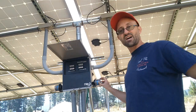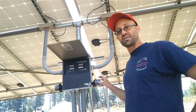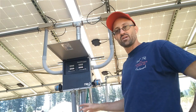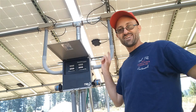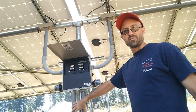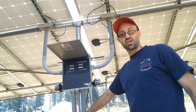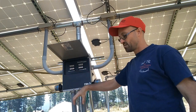These pieces on the side are just simple on/off switches — they're a combiner. Basically they take all the power from all the panels and run it into one feed going into the garage. Now these pieces on the side are just big surge protectors. They call them lightning arrestors, but they work like a surge protector for your house. If you get too much power, these things pop and protect all of your delicate equipment inside the shop. They prevent power from overloading your system.